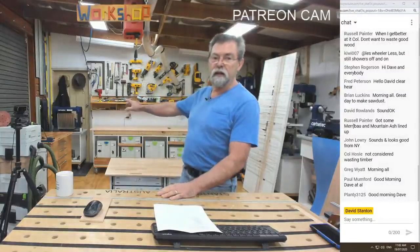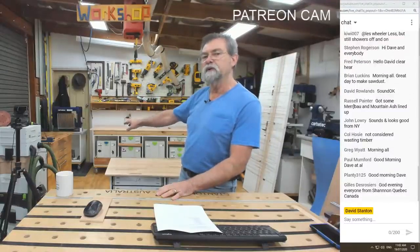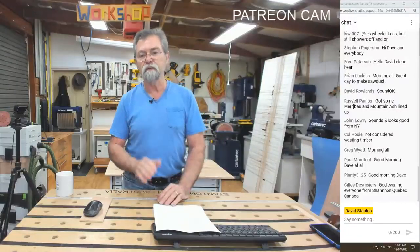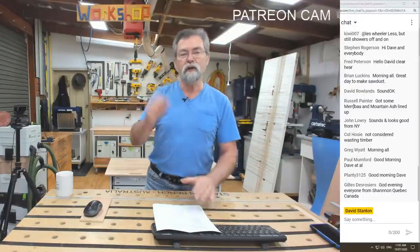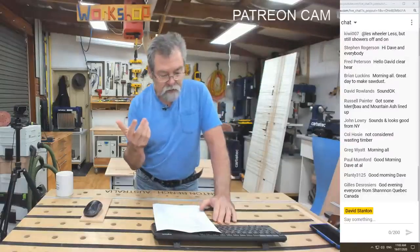I've done my unit over the back there, the CNC cabinet that I built, to 4,000, built it over a year ago. The finish is beautiful on it. I want the finish really, really glossy on this because every now and then on the lathe, I will use polishes or the micro mesh with water, and I don't want it getting into the timber at all. So the Liberon finishing oil is what I'm going to use. We'll do the first coat, bottom and top, and you'll see the difference between a 120 finish and a 4000 finish as to how it looks. You'll get a super gloss with the 4000, almost impossible with the 120.